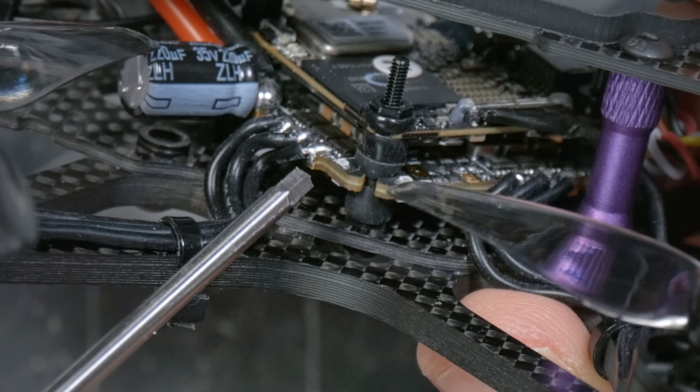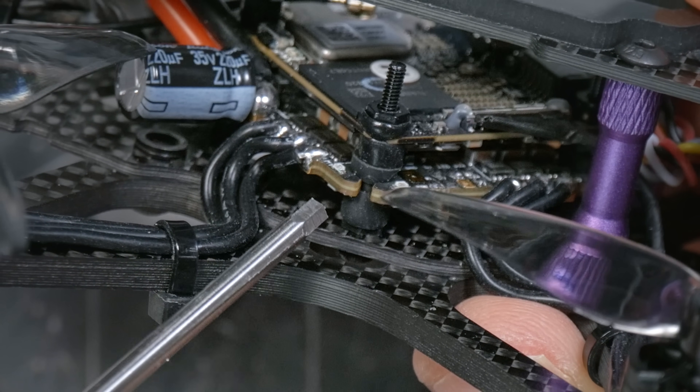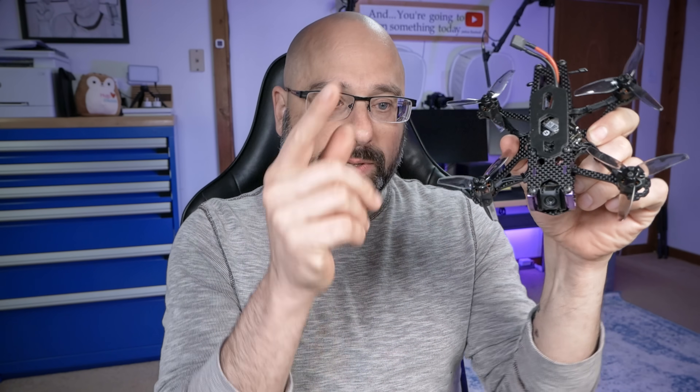This board on the bottom is the flight controller, essentially the brains of the quadcopter. It takes inputs from your controls telling the quadcopter what to do. It has sensors like a gyroscope and an accelerometer that tell it how the drone is moving in space. It does calculations and decides how to make the motors spin — for example, pitching forward means the back motors speed up and the front motors slow down, or to descend, all motors slow down.